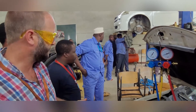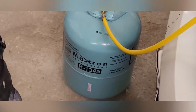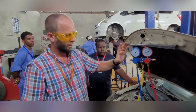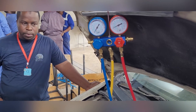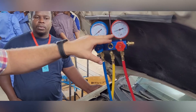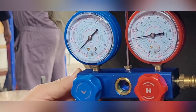To recharge, it's pretty simple. You open up the valve and make sure you have the right gas, which is R134A — it's used in most cars. Only very new cars starting from 2018 use a different gas; until then all cars use R134A. To recharge, you open up only the low pressure side. The tank has more pressure than the low pressure side, so once you open it you are refilling the system while the car is running — that's the only way to do it this way. You can already see the high pressure side going up, so you have to check that you're not overfilling.